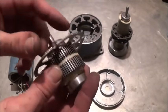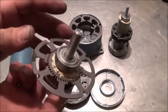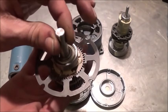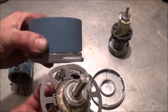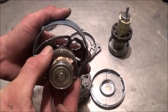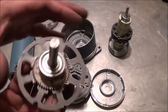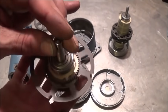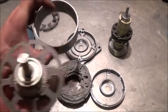We're going to do that until we get all the way to the top. It's going to take me quite a while to get this all mounted and glued into place. The next step is I'm going to have to put this into a table where I can spin it nice and fluidly without any wobble. I'm going to have to set up a grinder because I need to remove just a very fine amount of this outer edge right here to fit that back in this case. Once that is set up, I'll just spin that next to a grinder on a solid platform, even it all out all the way around, and move just enough material to give me enough air gap so these will rotate without touching.